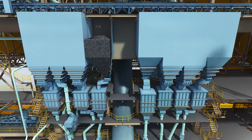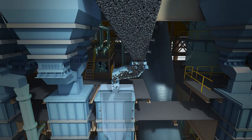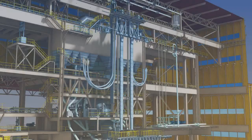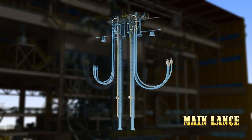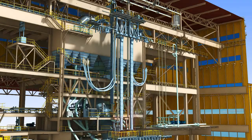The flux material for the blowing process is stored in the high level storage hopper during the charging of scrap and hot metal. The amount of flux needed for blowing is set, weighed, and discharged by the magnetic type vibrating feeder and stored in the weighing hopper. There are two sets of main lance installed at both sides of the converter, and the lance for oxygen blowing is moved to the operating position by hydraulic cylinder.